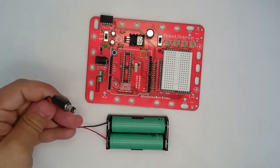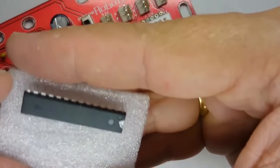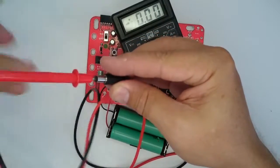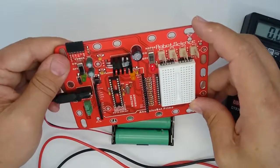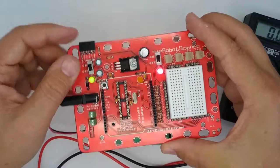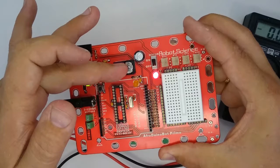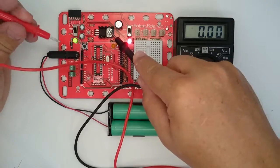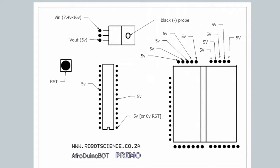Place the batteries in the holder. At this point, hold the wires — if the wires get hot or if you can smell plastic burning, immediately remove the batteries and check the wiring in the plug for a short circuit. Before you fit the microcontroller chip onto the printed circuit board, connect the battery pack to the board and switch the power on to check that the power and motor LEDs light up. If they don't light up, there could be a problem with the soldering around the switch or a short circuit somewhere. With both switches in the on position and the LEDs glowing, carefully put your finger on the voltage regulator — if it feels burning hot, there is a short circuit and you need to disconnect power.